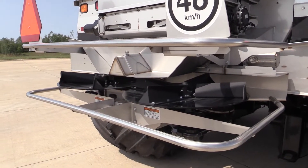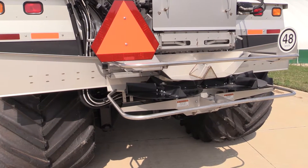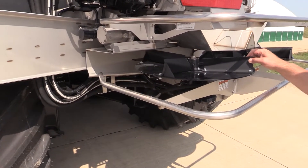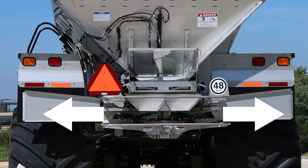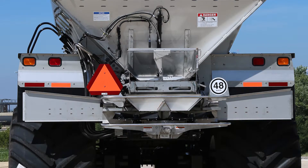At the back of the machine, we are now viewing the G5 spinner assembly. This spinner assembly is built off of the G4 using the same spinner disc, which are very low trajectory and they pierce through high winds. The spinner is hydraulically shifting left and right and fore and aft, precisely placing the material in the appropriate spot for precise patterns through varying rates.